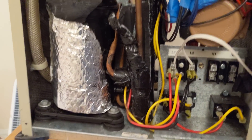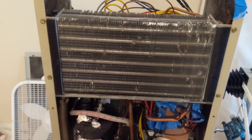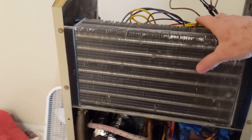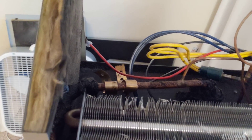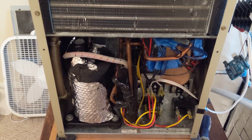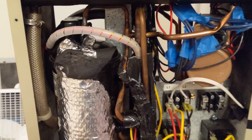The biggest problem I've had is that the evaporator freezes up. It used to have a sensor that would detect frost and cut out all power to the compressor, but that doesn't work when you're trying to run it as an air conditioner. I've been trying all kinds of retrofits to increase the evaporator pressure and evaporator temperature — trying to get it above 32 degrees. I've messed with the TXV, tied together the output of the evaporator to heat up the sub-cooled liquid coming in to try to increase the pressure. It works better now than it used to, but not as good as I'd like. There are no service ports, and if I start messing around, I'm going to end up releasing refrigerant, and I don't want to do that.